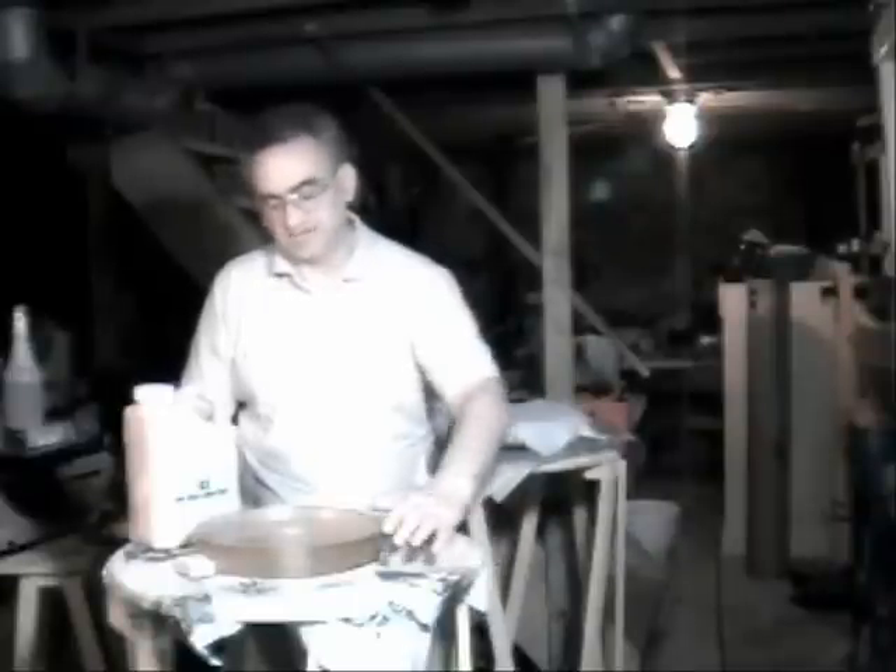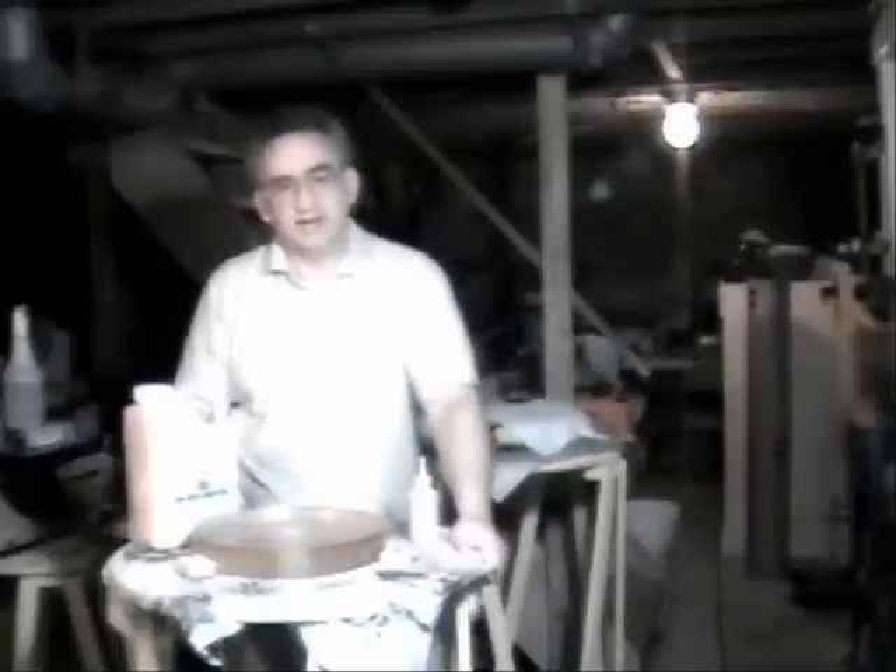Today we will be polishing the second flat of the three flat series. I don't anticipate spending four hours today polishing — that's just a little bit too much. I generally go one hour at a time. I'm going to be starting with my pitch lap on top because that works the outer edges of the flat. I may spend an hour during the process polishing with the flat on top — that remains to be seen. So that being said, let's get started.